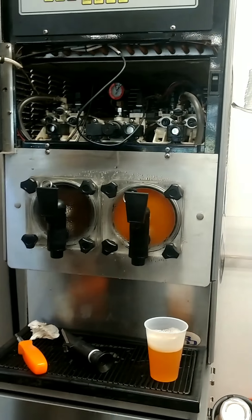So we're reading 14 brix, so we're going to have to adjust the brix down — that's reducing the syrup in the mixture. To reduce the syrup, which lowers the brix on the refractometer, put your small straight screwdriver on the right side of your mixing valve and turn it to the left, which is like unscrewing a drywall screw. If you want to increase the syrup, you turn it to the right, but we've got to decrease it so we're turning it to the left.